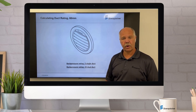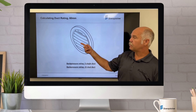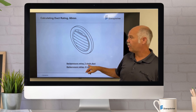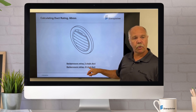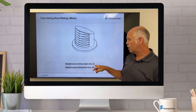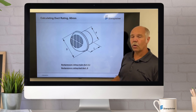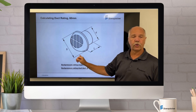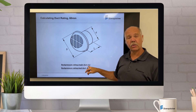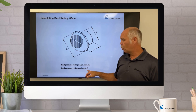Consideration of what grills you use is very important on the suction side and the outlet side. An outlet grill that's a 60 millimeter flat has a back pressure rating of 0.5, but on the multi-duct it's 0.15. A raised grill changes that — single duct 0.8, dual duct 0.15. You can go as far as an example we have one referred to as an eyeball, which protrudes from the wall and is rotatable, but its back pressure rating on single duct is actually 3.2, where multi-duct would be 0.8.